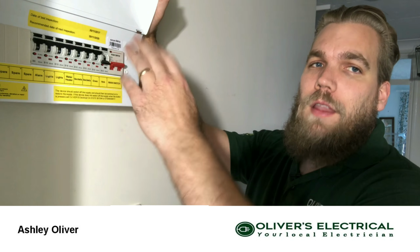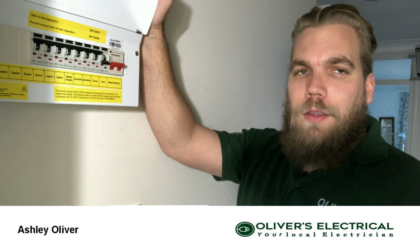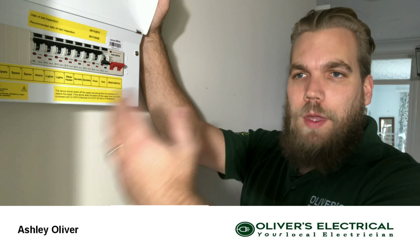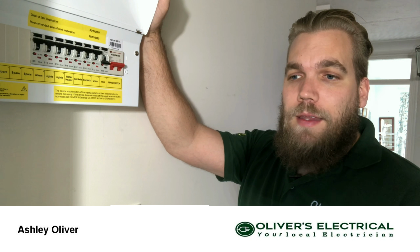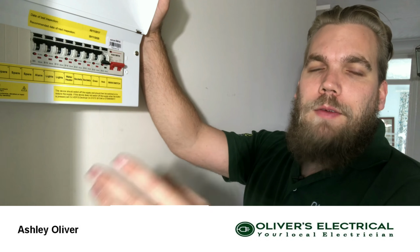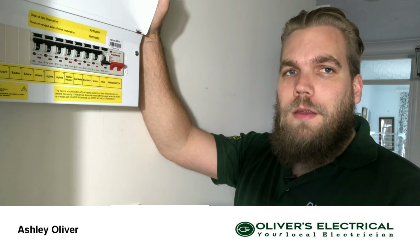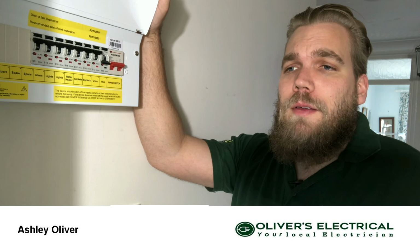They're still on the circuit, and then 9 times out of 10 you'll go back, switch it on, and it'll go back on. And then don't rush round plugging everything back in super quick. Plug one thing in, wait a little, not saying wait ages, just wait a little bit, plug something in, switch it on. If it's a light, switch the light on. If it's anything else, a Hoover, switch the Hoover on, whatever. Just do that, and then you'll find you'll get to one point and you'll plug something in and bang, it'll all go back out. And at that point you know that that part or that item is faulty. So then just leave that one out and carry on with it.